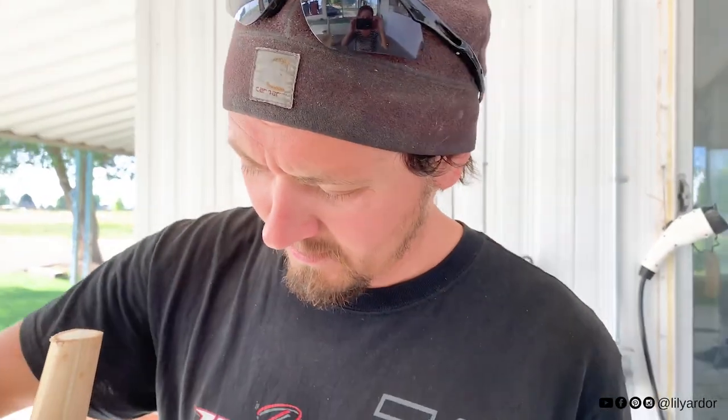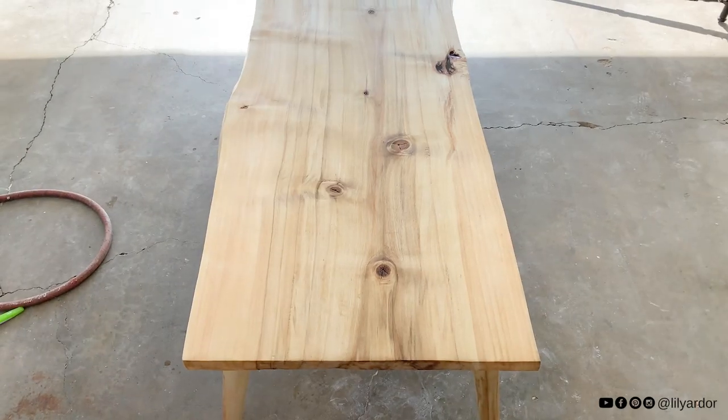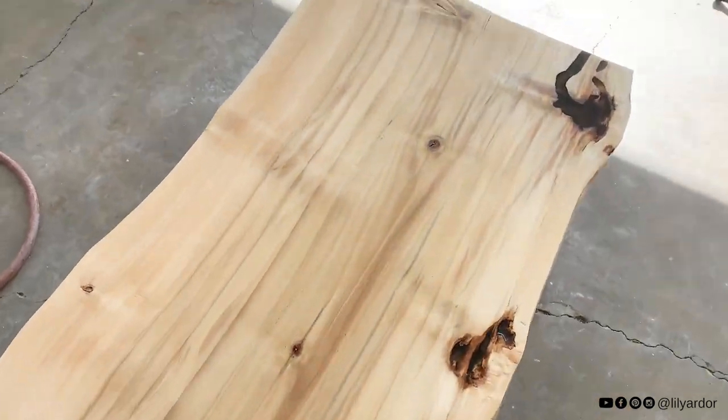This table - we're not professionals, we're just doing how we do it. If you have the right tools, do it with the right tools. We tried to stick to our budget and used whatever tools we had - sawzalls and grinders and hand sanding. But it worked out all right. If you plan to seal your table after oiling it, make sure you let your oil cure for at least 72 hours before applying any clear protector or polyurethane, because it will bubble. I've had this happen to me, and it's horrible.